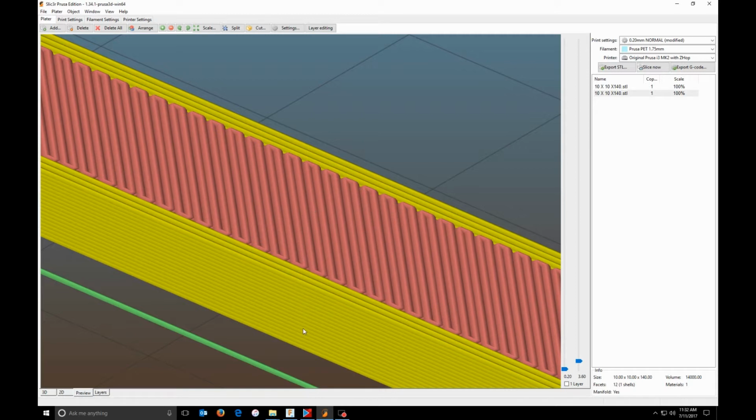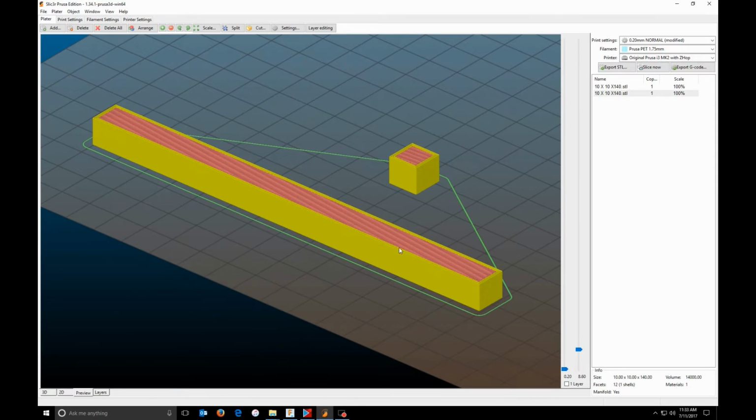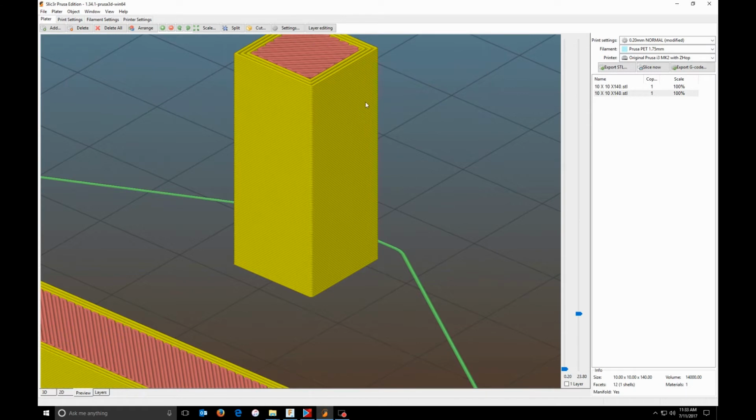But keep in mind, as this is extruded lengthwise, think about it as layers. If you use an ABS or PETG, whatever the material is, it's how well it sticks to each other that gives you your strength over the length of this. However, and think about this for a second, when you start depending exclusively on the adhesion of each layer, it's not a continuous melted piece. So lengthwise, that's basically melted together extrusions that run the length of the item.